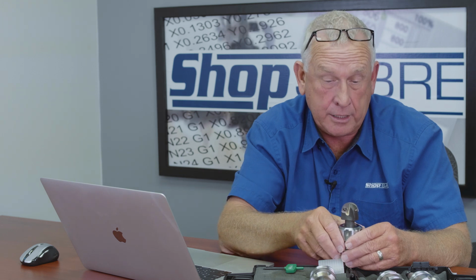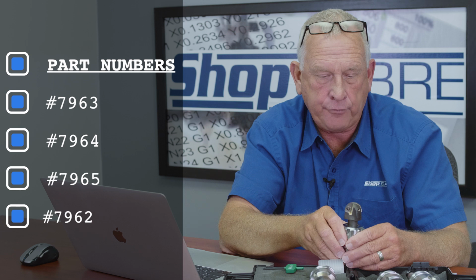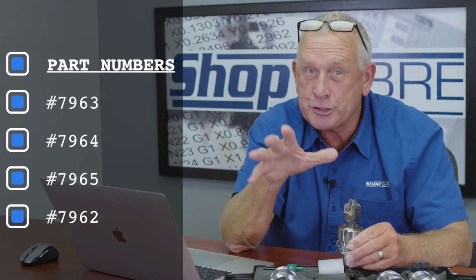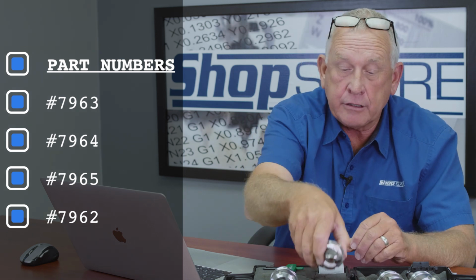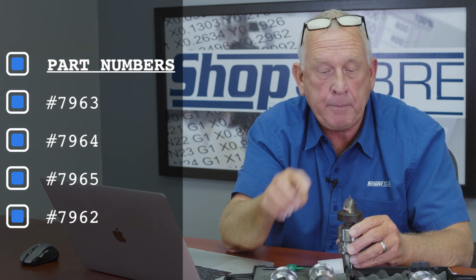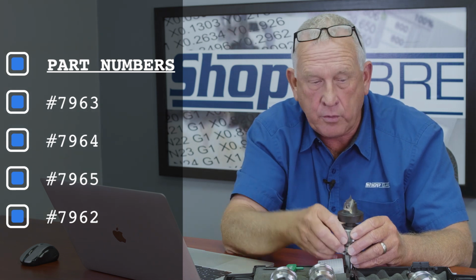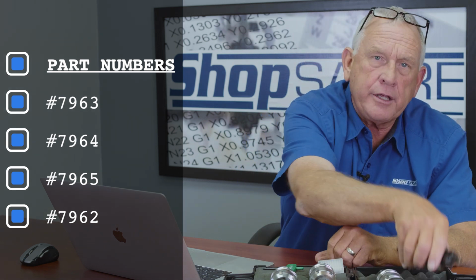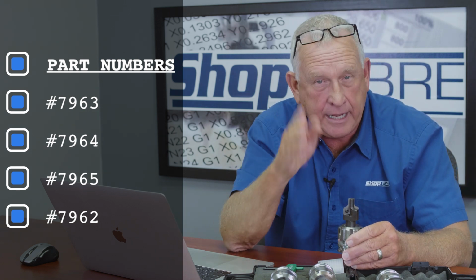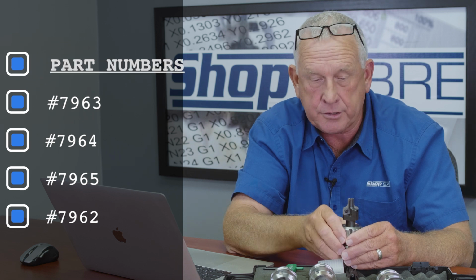And keep in mind they have 3/4 inch shanks, so you'll need to get 3/4 inch collets with this set if you get it. The first tool creates what we call a panel, so it's the first machining that we do. Then we follow up with a bead, and between those two it starts to look like that raised panel. Then the third cutter is a bead cleaning tool, and it's used twice, at the top and the bottom of the bead, and that's where we get the sharp square corners. And then the fourth tool we're not using today, this is actually for the outside of the door. In my case, I wanted the outside straight, so we're using a straight bit. All right, so that's the Vortex tool set.